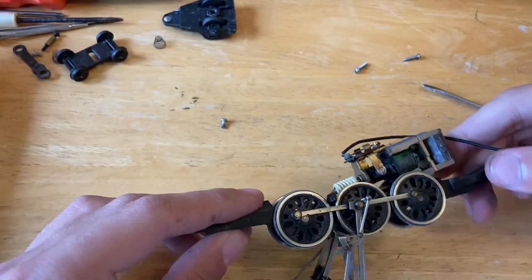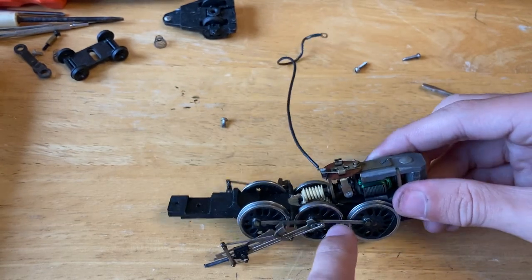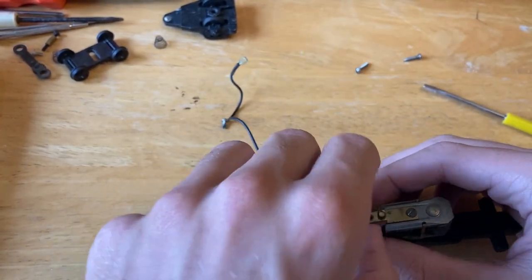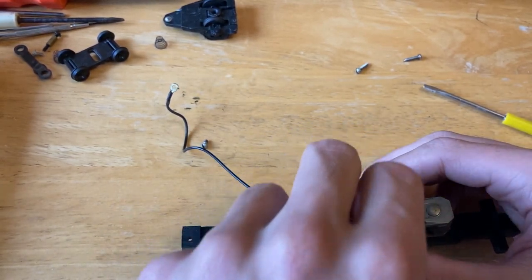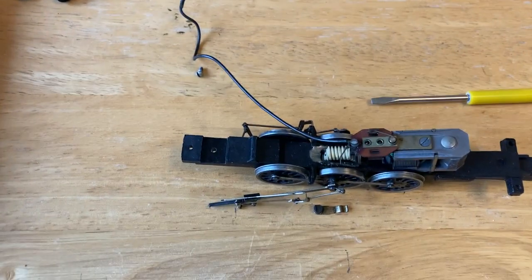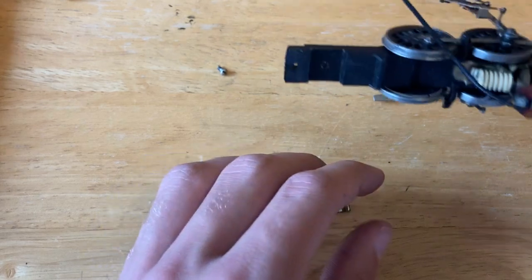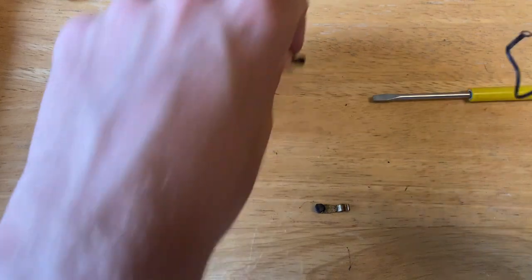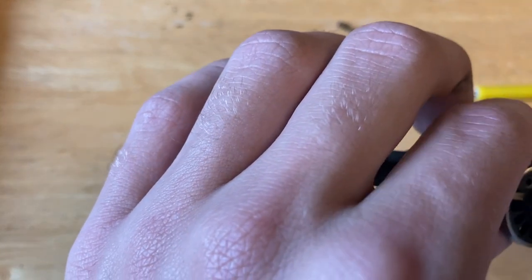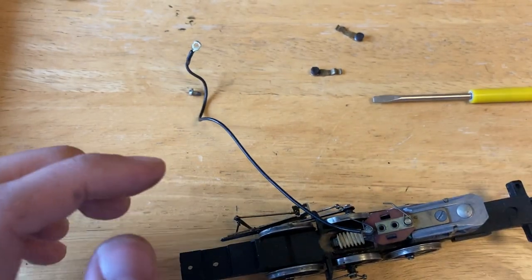Let's see how to disconnect the motor. First I'm going to look at the commutator — try to get some light reflecting in it, it's fairly dirty. This is very similar to the Varney engine restoration. Just have to move the little pin, angle it a little bit — there we go. One or more of the brush holders — let's keep those to the side. We have a very dirty commutator. This is a five-pole motor, it spins pretty freely in its spot so that's not bad, but we'll start the scrub down of the commutator.